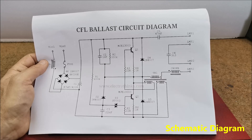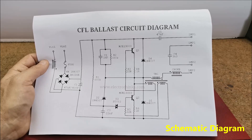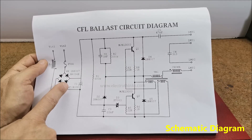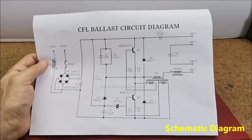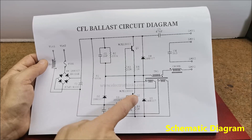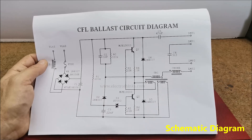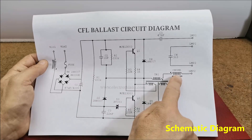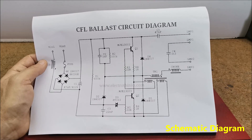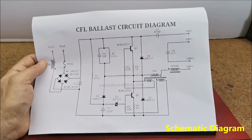First of all, about the way of powering these bulbs. In general, the schematic diagram is the same for all types of CFL bulbs and consists of several parts: a rectifier consisting of 4 diodes connected in a so-called bridge junction with a filter capacitor; a switch mode converter containing 2 switching transistors and a small toroidal transformer usually with 3 windings; and a choke winding that serves to limit the current and has the form of a standard transformer.